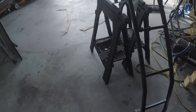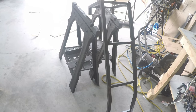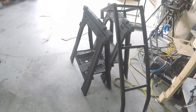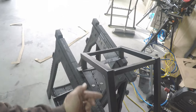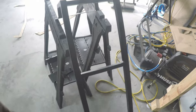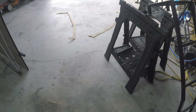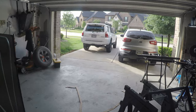Here's the ladder coming together really easily — this is like the second or third one I've built and it's not complicated. I work in square tubing because I don't have a tube bender yet and don't want a kinker that doesn't create proper smooth angles. Round tubing would actually be super simple — just bend some angles in and then create the rungs, which you can do with a pipe notcher. You weld it anyway so you can fill any gaps, but square tubing is my preference on my truck.